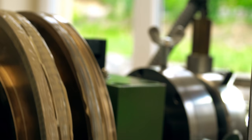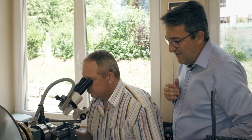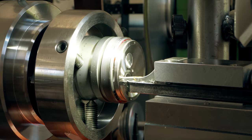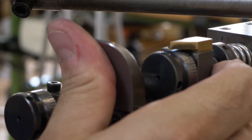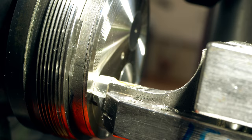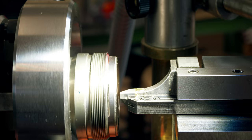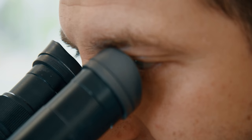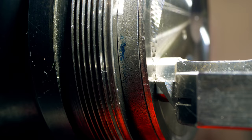The first step of making a guilloché-main is creating the initial thread. You do it with the chisel and the guide. The guide maintains the maximum depth and the chisel comes to cut the metal. Here with the thumb, the pusher maintains gently the pressure to create a perfect cut. Here Sylvaine is preparing the first half of the décor — it's a circular motion all across the plate, starting or taking as a center one of the two sub-dials. The eyes are fundamental because it has to stop exactly when the lines are crossing the initial thread.